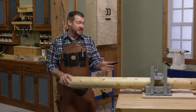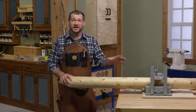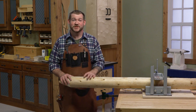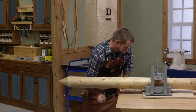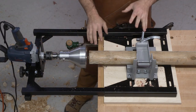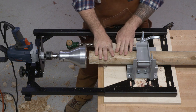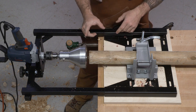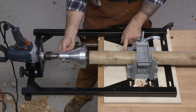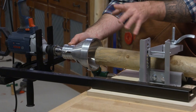We're going to go ahead and drill the mortises after we install the posts into the ground. So let me move another tool in here so we can create the tenons on the rails. Our rails here are a little bit smaller than our posts — these are three inchers. To create the tenons on the ends we're going to use this tool, which will cut a tenon that seats into a hole in our post. We'll drill that hole a little bit later.